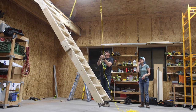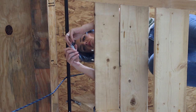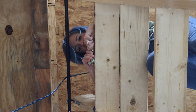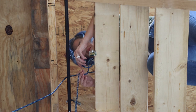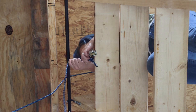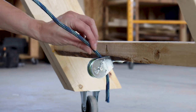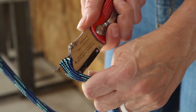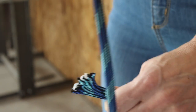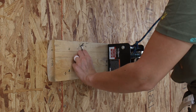We took a day or two to think about what we wanted to do, and in the meantime we moved on to the folding mechanism. It involved attaching two smaller screw eyes to the back side of the top tread of the stairs, then tying the end of a length of rope to one of the screw eyes and adding a pulley to the second. We added another pulley to the back side of the bottom tread and began to string the other end of the rope up through the top pulley, giving ourselves plenty of length to come back down to the ground. The new diamond braided rope we swapped in was easier on the hands, and being nylon we could seal the ends using a lighter.